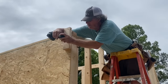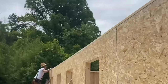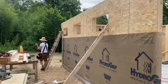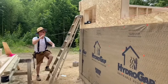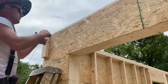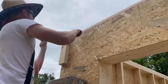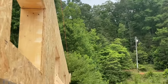Here's one super important step that I've seen a lot of people skip: straighten all of the exterior walls before you set a roof or floor system on top of them, locking them in place. This wall was actually pretty crooked until we straightened it. What we're doing here is pulling a string line from one end of the wall to the other, spacing it off the wall an inch and a half with these blocks, then going down the length of the wall checking that the distance stays an inch and a half the whole way.